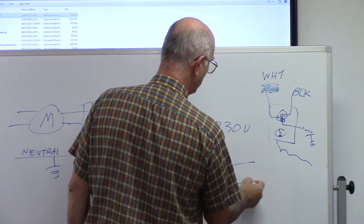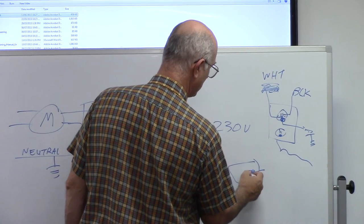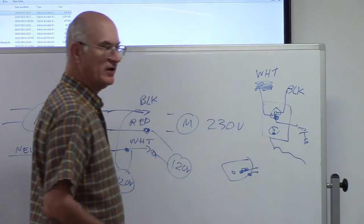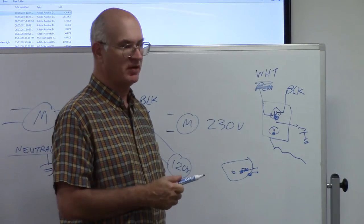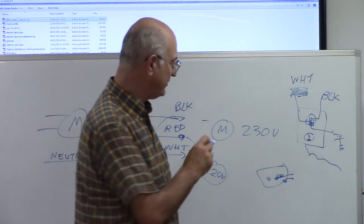In the old days, they used to wire your radios. They used to have your AC come into transformers and so on to run it. And the other wire was connected right to the chassis of the radio. So be aware, if you ever are working on older equipment, pre-1960s vintage stuff, that chassis is hot.